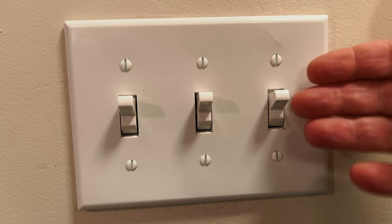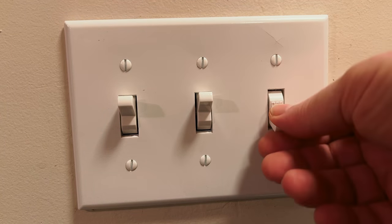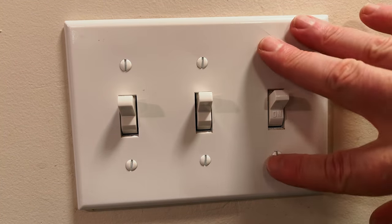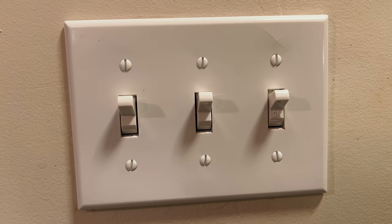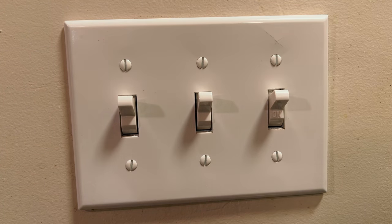The bad news is that without the retaining ring they sit back from the front of the switch plate and look a little crappy. I'm sure someone in the comments will tell me why using spec-grade switches in a residential application is stupid or what I did wrong. I tried to loosen the mounting screws so I could use the switch plate to pull the switches forward and make it flush, and I wound up cracking the switch plate — so I'll have to address that. My understanding is there's residential cheapo switches, then spec grade as the next level up, then commercial. I kind of expected to get a flush fit. I'll keep fiddling with it. Anyway, thanks for watching — like, subscribe, and we'll see you on the next one.